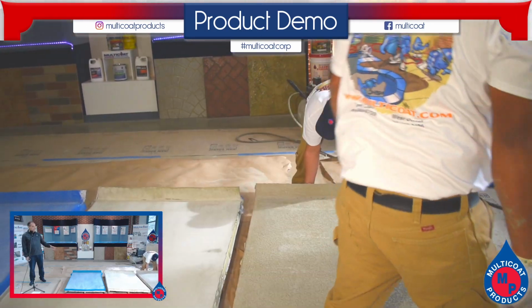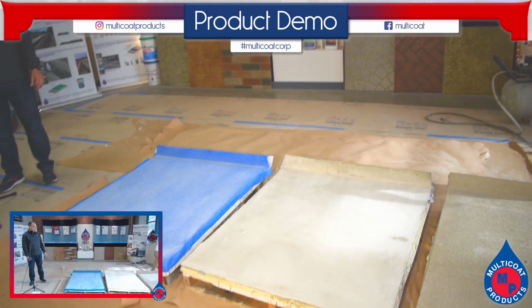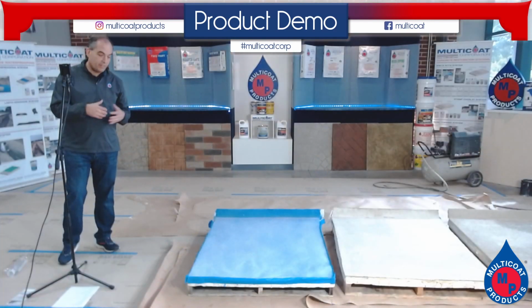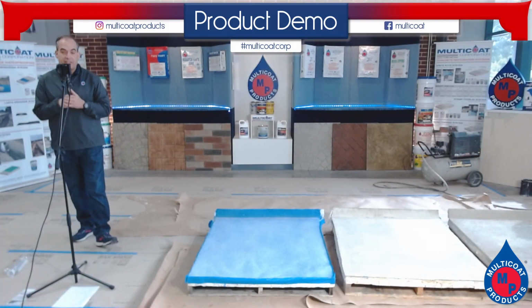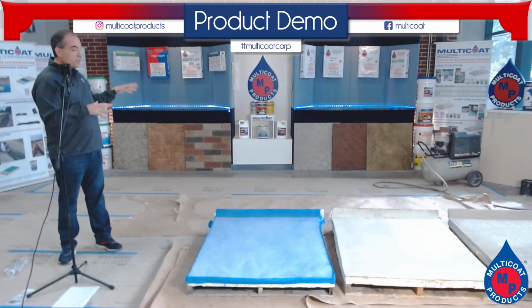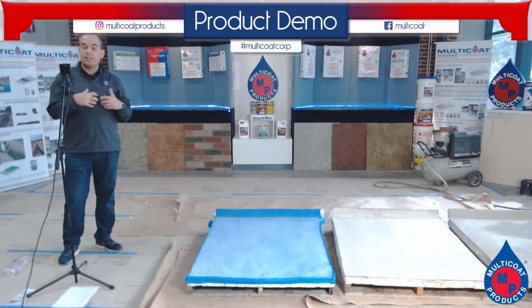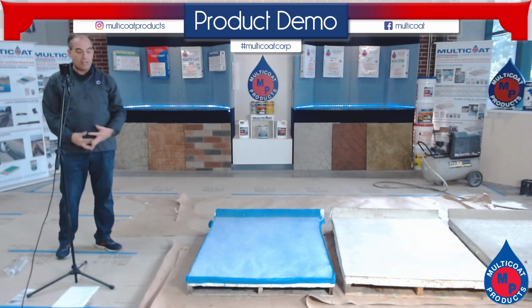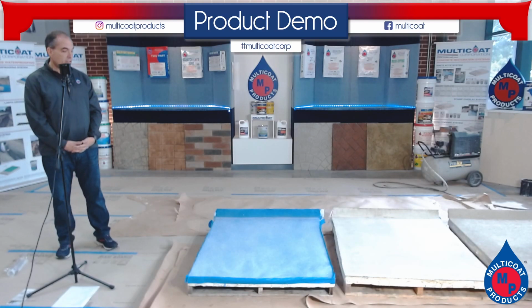So we're going to finish above grade decks. The system we're showing you is on wood. For concrete, it basically eliminates the metal lath and the multi-base, and we typically apply our vapor shield product like we showed before, and then we do a skim coat of our scratch coat product. And after that, you could follow pretty much similar steps as you're seeing here.